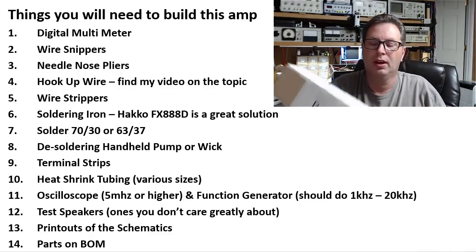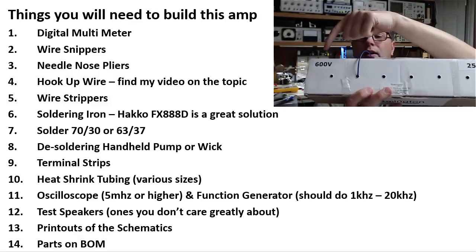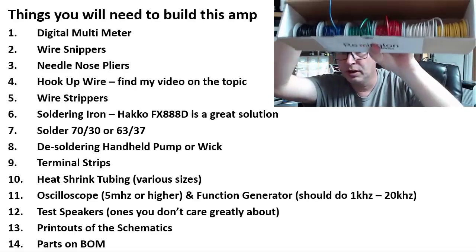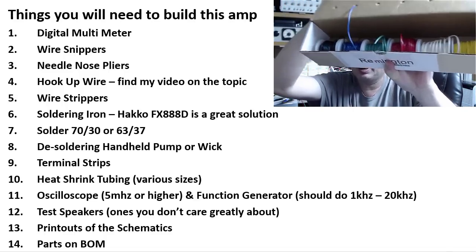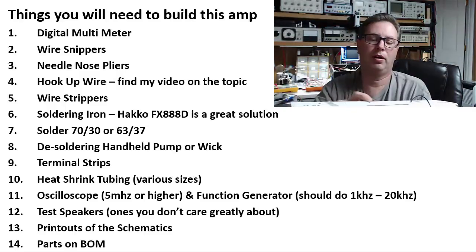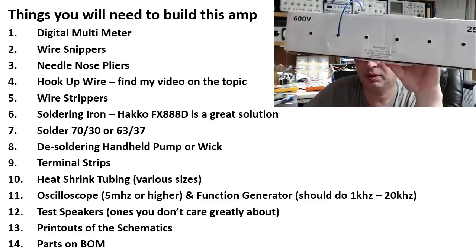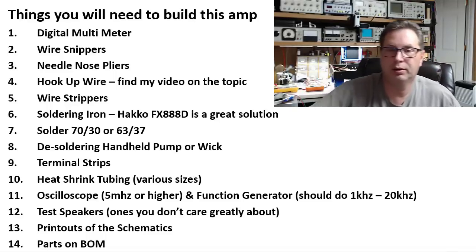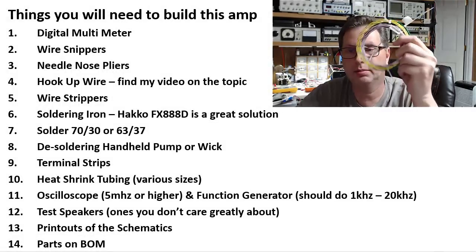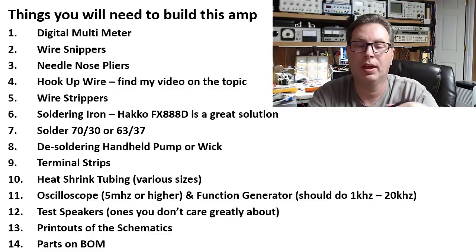There's hope — you don't have to go the Teflon route. This nice little box from Remington Industries has 25 feet of each color of 600-volt hookup wire: yellow, white, red, blue, black — just about every color you need. The part number is UL1015. This was about $25 to $30 on Amazon and could pretty much do a whole amp. I'll link below to a full video I made just on hookup wire. If you're building lots of amps, Teflon is the way to go; otherwise stick with PVC-coated wire.